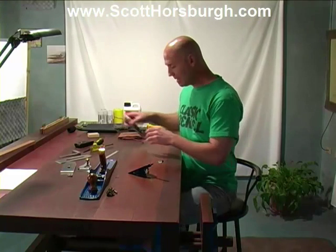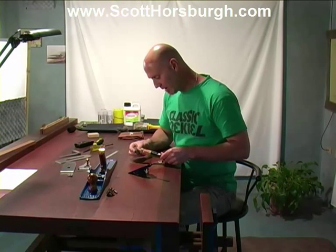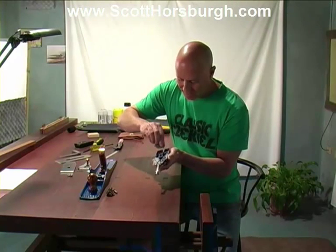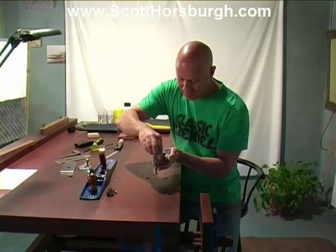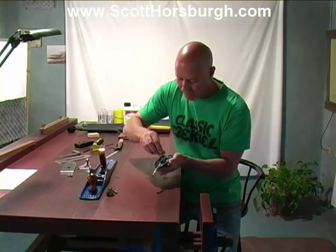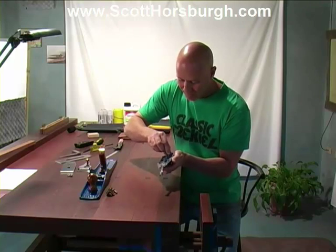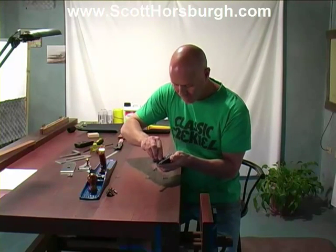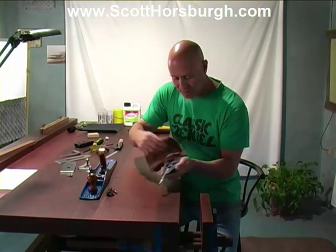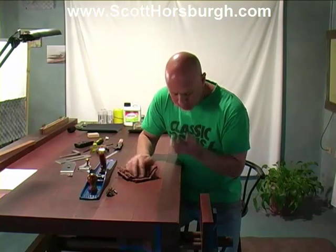All I'm going to do is give it a rub down with some metal polish and wire wool, just to make sure that it's nice and smooth. And that is all I'm going to do to the top surface. So I'm just going to get some metal polish all over those steel surfaces, and then I'm just going to rub it in. I want to be able to retract the blade and then wind it out very easily. I don't want it to get caught on nicks or bits of steel. If you had any sharp pieces of steel protruding, you could also just use a file. Just going to clean that up. Make sure there's no metal bits floating around.